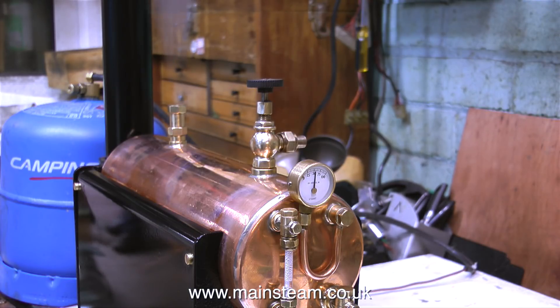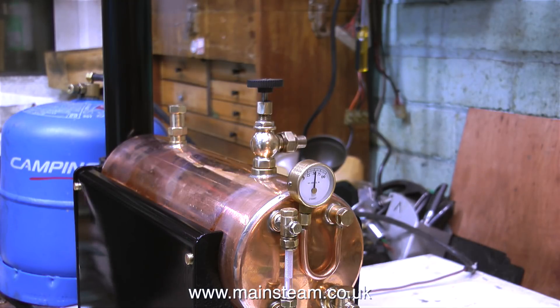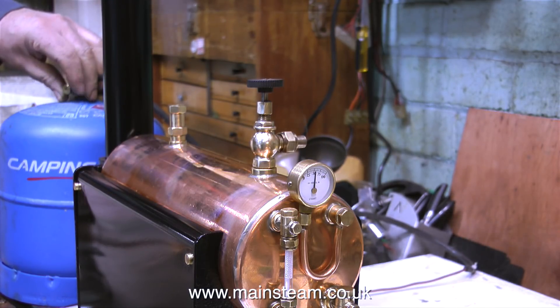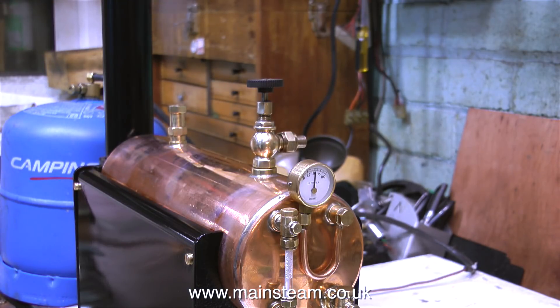One or two viewers missed the point entirely — I'm not using the cyanoacrylate adhesive, or CA glue, or super glue, to permanently fix the thermal insulation to the side panels. Just like on the original design when the boiler used asbestos panels, the panels are trapped between the side walls and the front and rear castings. The good news is my carbon monoxide detector has not gone off. The bad news is the smell is getting worse, so I'm now going to turn off the gas, disconnect it entirely, let the boiler cool down, and hopefully the smell will have gone by tomorrow. Thanks for watching and I hope you found it useful.